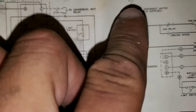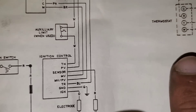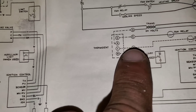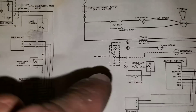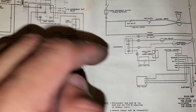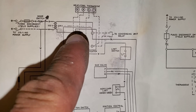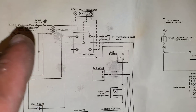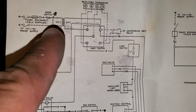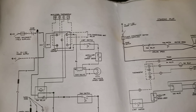That means I or the installer will be responsible for the high voltage portion. If you look at the thermostat, you can see we have thinner lines — this is going to be for my low voltage. So just looking at my schematic, I know we have high voltage and low voltage wires. Here we have the same concept: 24 volts for my low voltage, and the thicker lines for my 115–120 volts coming in.